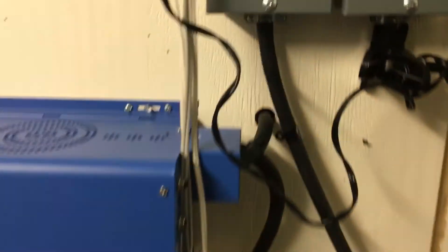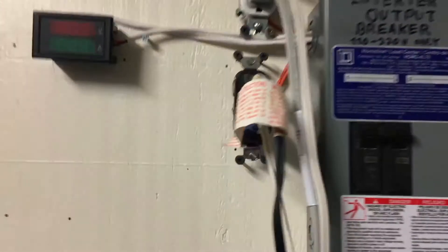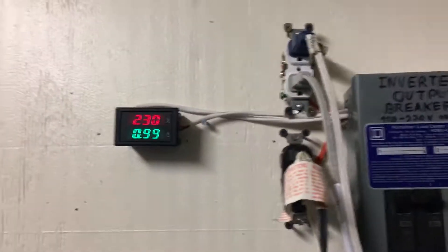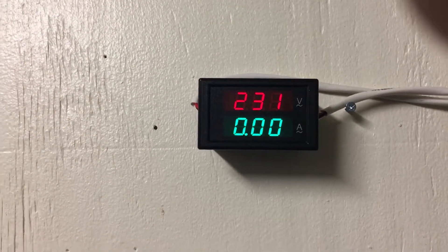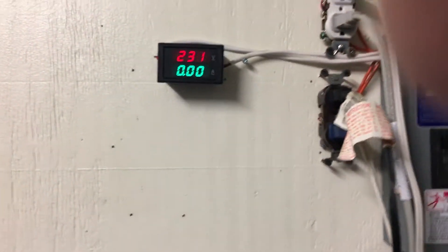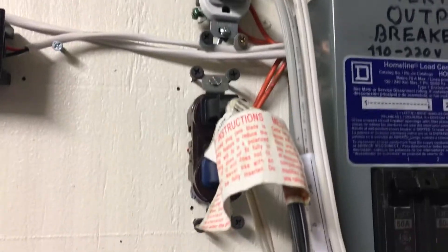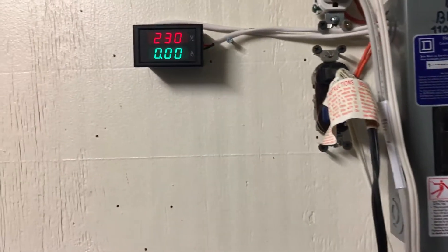There you go — that's a good 60 Hz. Now I turn on the breaker here, the 50 amp breaker — this fan came on. Turn it off right now. This inverter is putting out 231 volts. That's the split phase — I got these two plugs right here, 110 volts each per leg, but together offering 220 to 231 volts.